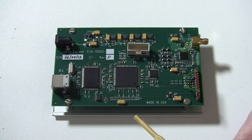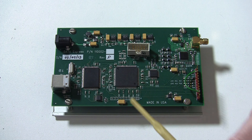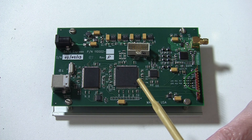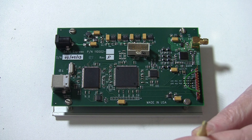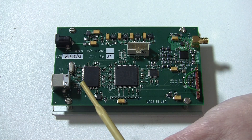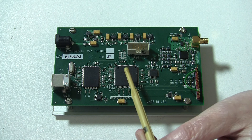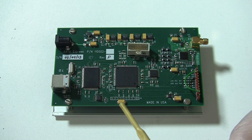It would be possible to connect a high speed A-to-D converter and digitise an analogue signal, process it inside the FPGA and produce, for example, vestigial sideband output for standard analogue television. We have no plans to implement that, but it's possible. It would also be possible to interface this with an SDR radio for transmit. The signal would come across at 192ks per second or 96ks per second, interpolated upwards to the final sample rate of 32Ms per second. There's enough space inside the FPGA to do that, so the board could be used as a UHF transmitter board.